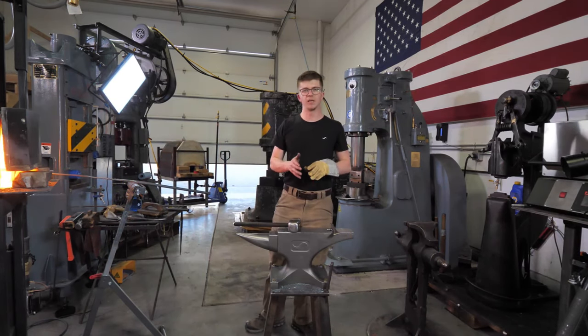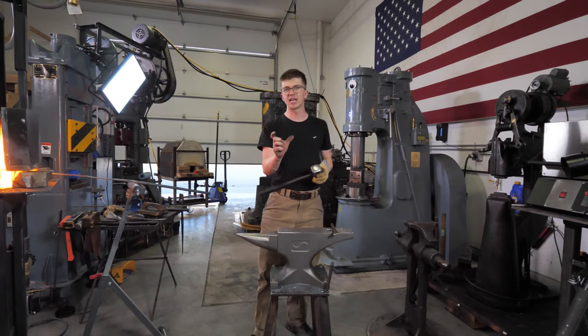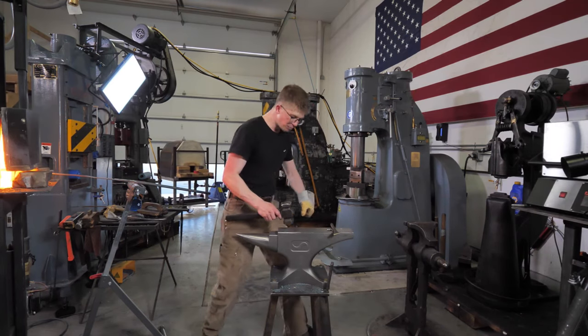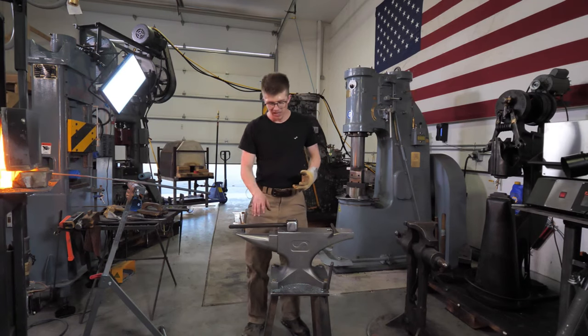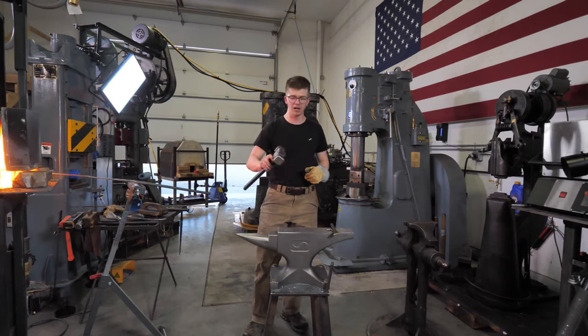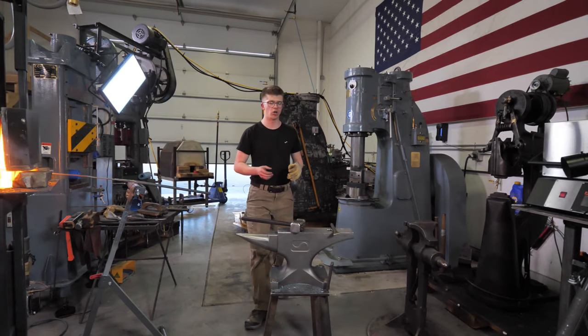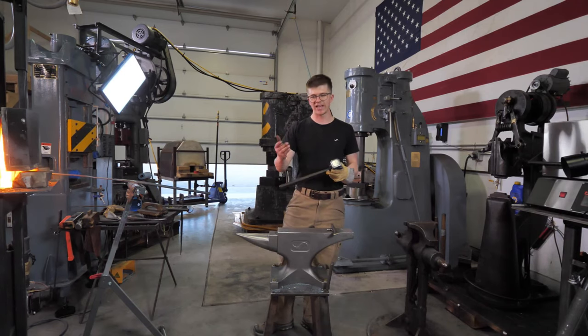But it's what suited me, using a heavier hammer and holding it closer to the head so that I didn't have to use a lighter hammer held further away. Helped me feel more comfortable at the anvil. Helps me get my body in closer to the work, helps me see my work. It just suits me. I'd rather swing this a little slower than take a lighter hammer and have to whip it faster. I feel a little more in control. So that's essentially it. Why does all of this handle exist if you rarely use it?